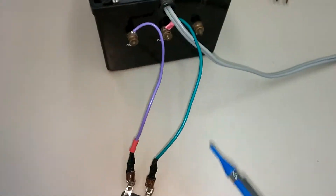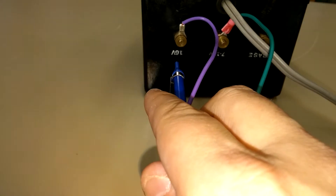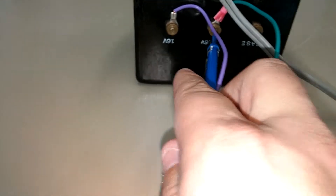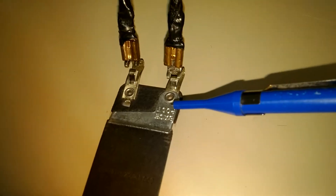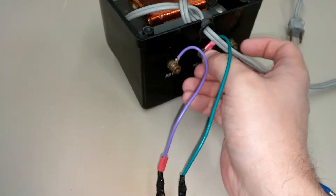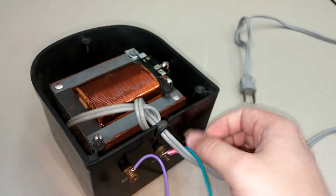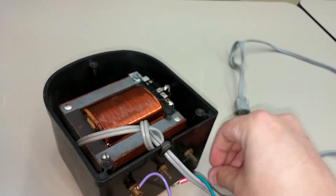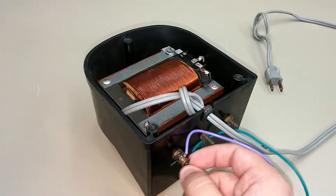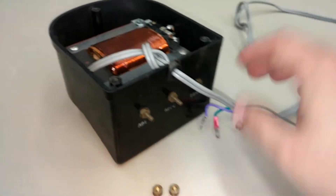The next thing I noticed was these two here are connected incorrectly. This is my 16-volt rail, and this is a 7-2 dash 16 volts — so that's my variable voltage, and there's my base. You can see right here it says base post, so this one needs to go over to the base post. And this third one here is actually for use with three-rail systems, not two-rail systems, so this one will be unused completely. That one will go over to the base post.